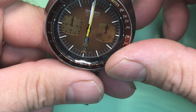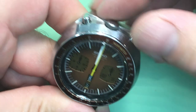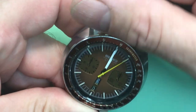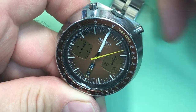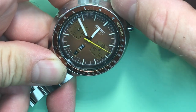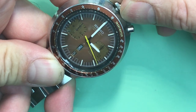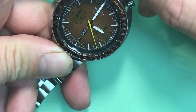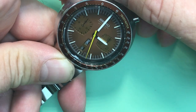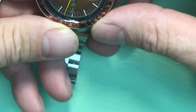I'm going to see if it's working. It may not be at this point — nope, it doesn't look like your chronograph is going around. I'm going to give it a bit of a wind. And there we go, we're taking off. See how we're setting with the hands — hand setting is pretty good. You definitely need some new seals, and you may need some looking at your cannon pinion — it seems a bit loose. Your quick date — that's good, both directions. So all in all, looks really quite solid.